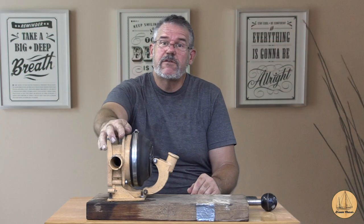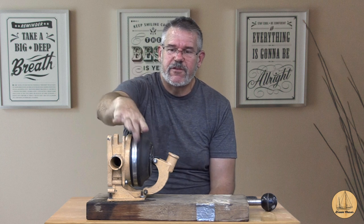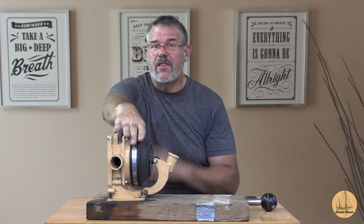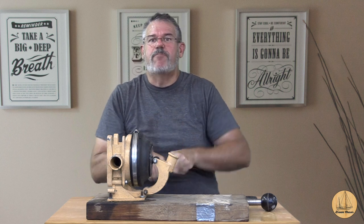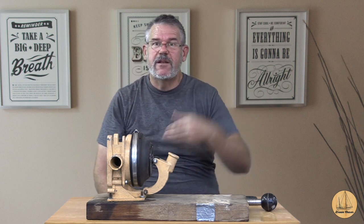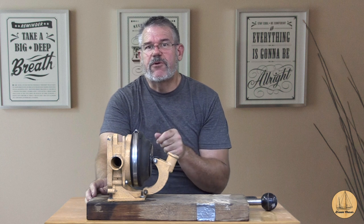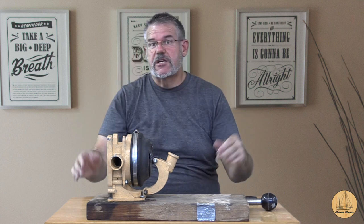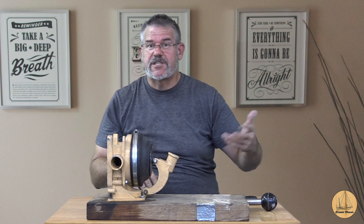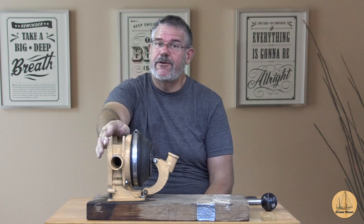So as you saw, it works - and the good news is it works exactly as I bought it. So for 20 bucks I got a $250 spare bilge pump. I did have to tighten up the clamp around the bellows, but everything worked really well. The flexible discharge hose isn't a great idea - the water would cause it to kink a bit and then pressurize and pop the hose up in the air. That Sterlite tub held 14 gallons - it's a 56-quart tub. We filled it all the way to the top, plus water going over the sides. I suspect we had about 16 to 18 gallons, so it's right at the amount in the specifications.